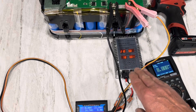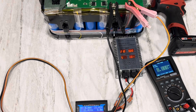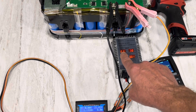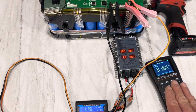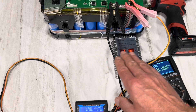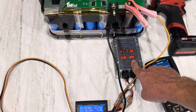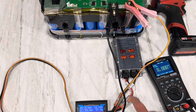This unit is rated for 400 watts and they come in 200, 400, and 600-watt sizes. Using a 100-watt panel — open circuit voltage at 20 volts — and charging a 51.2-volt nominal lithium iron phosphate pack, that is awesome. This is a great little thing to have around. If one of your main chargers goes out, you can always use a small panel to put some charge into your battery.